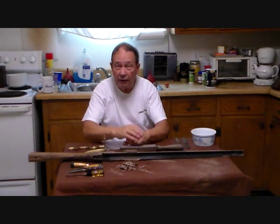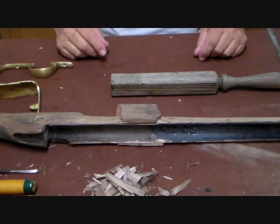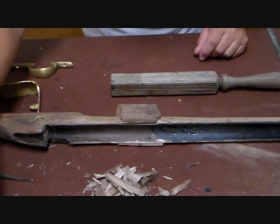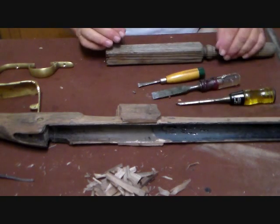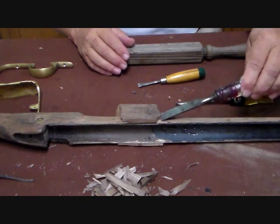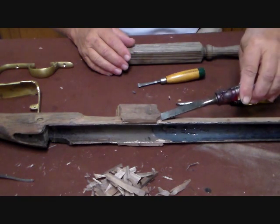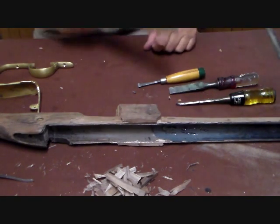Now, I'm going to bring up the camera so you can actually see me move some wood and show you how to go about it. God loves straight-grained wood and sharp chisels, and we have some of both here, I'm glad to say. Now, when you're working on a block like this, what you don't do is take your biggest chisel and put it right down here against the stock and start pounding on it. No, you work on the edges and then you go inside.